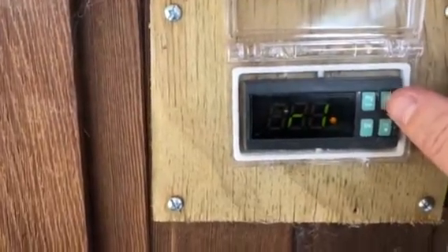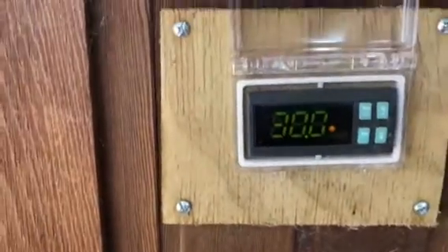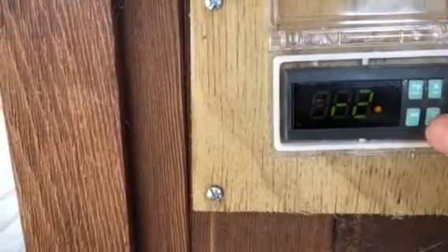R1 is basically the minimum set point you can select when adjusting your set point. I've got this set at 30 degrees because I'm going to be using 38 as my set point, so 30 is the minimum. It'll cycle from a minimum of 30 — the range can go right down to minus 50. Press Set again to exit.